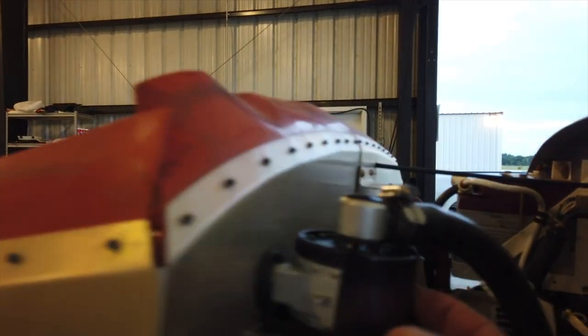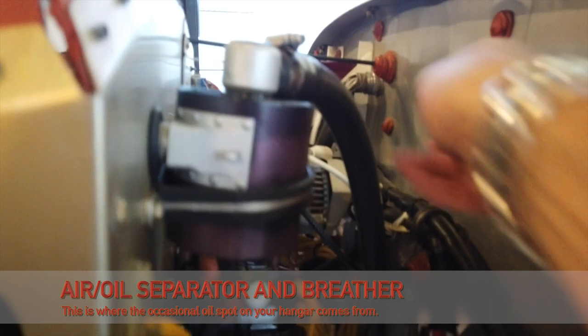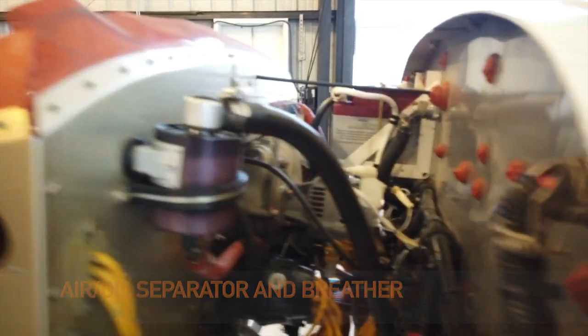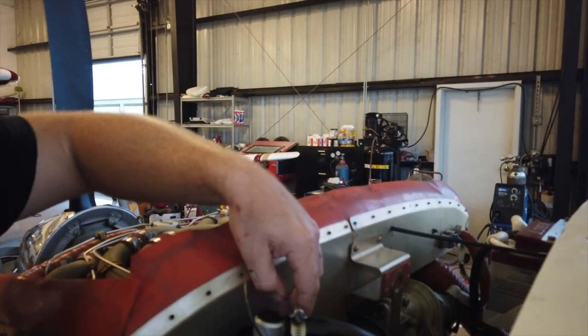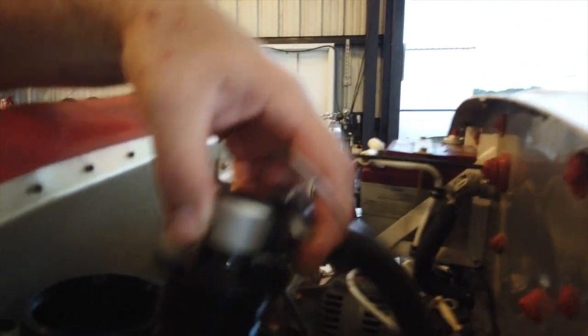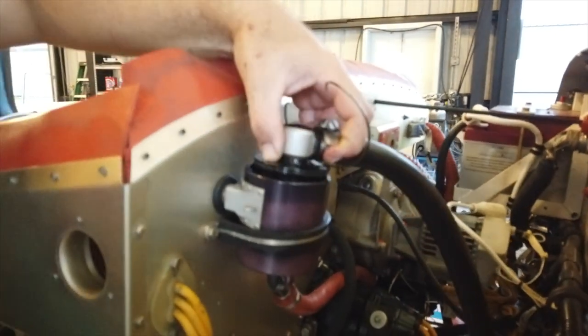You said you were going to show me this — yeah, that's where the oil's coming out of, I think. Because it goes down to this tube right here. Is that the breather — oil breather? So you have a crankcase breather. That's going to be your breather to the exit, air-oil separator, and oil drain back to the accessory case. So it would be coming out of here, and that makes sense because sometimes I see it down there. It has vanes with oil — that's pretty dry. All it's doing is separating air and oil. The vanes just prevent the oil from climbing.